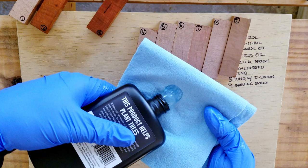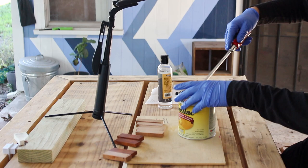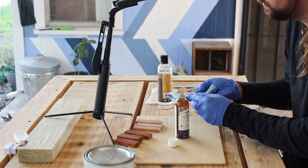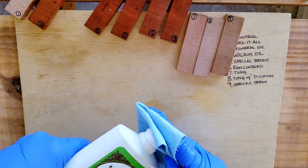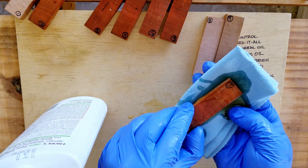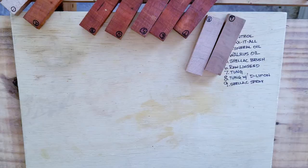Next is walrus oil — it does not contain real walrus, but it does contain coconut oil, beeswax, mineral oil, and vitamin E. It really has that coconut oil texture, which is weird for a finish. Next up is shellac — this stuff kind of smells like apple cider to me. Next is linseed oil, which apparently is made from flax seeds — I did not know that. Next, tung oil, which doesn't smell that great. Tung oil takes a bunch of coats and lots of curing time, but once it's dry it creates a sealed exterior layer which I think is what we're looking for. Also, if you use it before it's cured it is not food safe. It has the consistency of like honey, which really helps it create that exterior layer of seal.